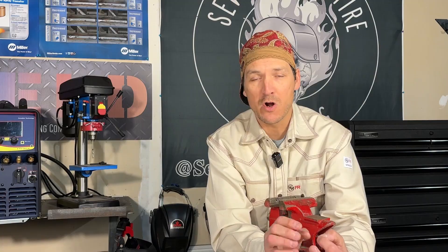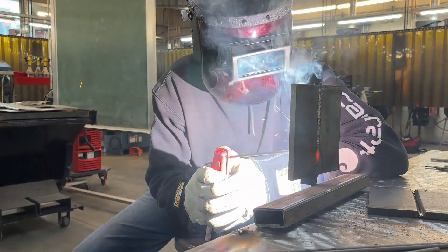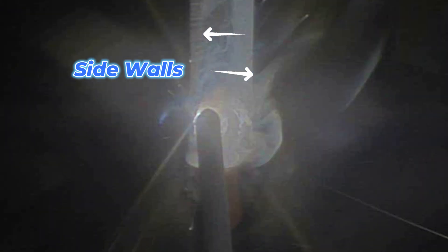Now it's time to use that 7018. We're welding at about 90 amps with a 3/32" low hydrogen rod. With that root nice and clean, it's time for the fill pass. We're going to use our run-off and run-on tabs to start this weld, especially in the beginning, as it likes to overheat and you don't want to blast through your root. I'm running a tight arc length and watching my puddle build evenly, using a slight weave to keep it flat and fill that joint without undercut. I'm riding the bevel edges and watching the weld climb up those walls. If you're focused too much in the center, your weld won't tie in on the sidewalls — make sure you're watching the metal flow up into that bevel. At all times, watch the toes of that weld and progress upwards slowly. Climbing too fast is going to leave little low spots everywhere. We want those overlaps and ripples to be nice and tight. Point into those edges to make sure that metal is flowing into the sidewall; otherwise it'll leave undercut. If you're not moving side to side fast enough, it's going to crown up in the middle and leave your edges filled with slag.